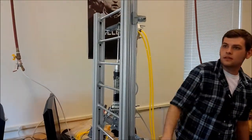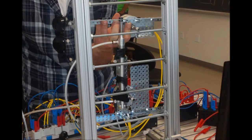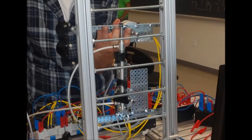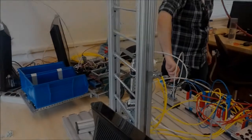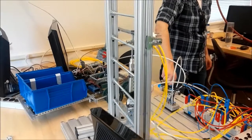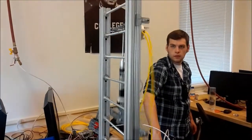But we had to go back and with electrical tape secure the reed sensors on each end of the dual acting cylinder. And here's our phase 4 presentation after the troubleshooting and the correcting of the reed sensors. As you can see, it's a lot more effective.